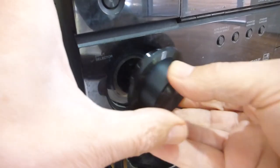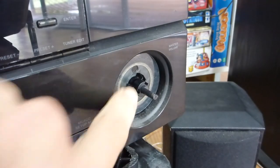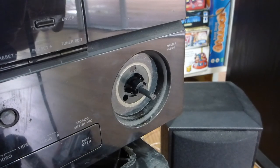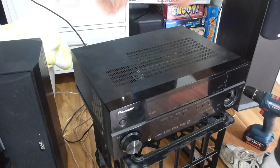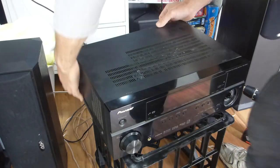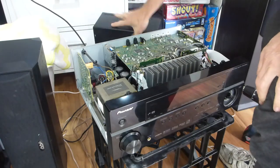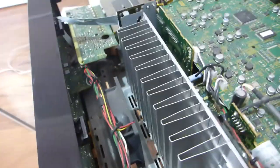The homemade function control looks beautiful. I'm not going to put it on yet because the next job is to pull the rotary encoder out and fix it — never trust anyone who says the amp works perfectly just because they power it on and show you the display. All the screws are out. The rotary encoder is going to be behind the front panel, so I have to pull that off. There's actually a cooling fan in here — I heard it spin up earlier.